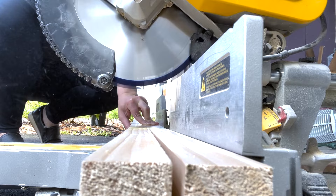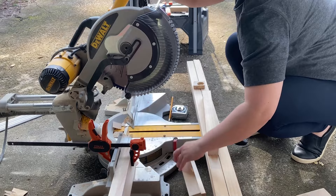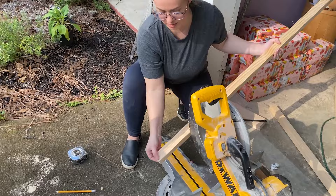So what we've done here is created a stop block. That is just some scrap wood that we've clamped to the miter saw so that we can repeat the same length of cut every single time. All I have to do is take this piece and push it up against the stop block, and when I cut it'll be the exact same measurement. So I can create multiple pieces over and over a lot faster by not having to measure. We are using every bit of this wood that we possibly can — that's the last cut needed, and that's the scrap.